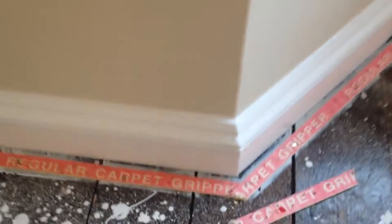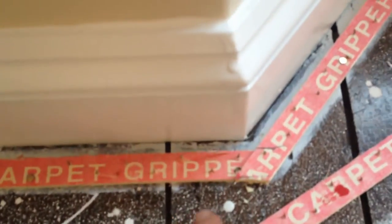Got one last piece to put in, and then we're going to bring in the underlay. It's just common sense with these - keep it 10 mil. Down here there's two little angles on this one, going one way, and that's a cutter there. Little angle there. And sometimes you'll have to take a nail out and move it over if it lands on the gap in the floorboard.